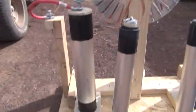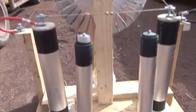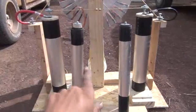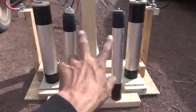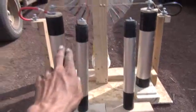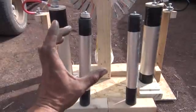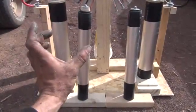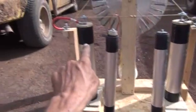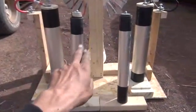What we've got here is a series of large-scale capacitors that I've used with the Wimshurst electrostatic generator, so we can do small-scale and larger-scale capacitance experiments. It's just a simple PVC pipe design. The large ones in the background are made from 3-inch PVC pipe with a cork top and an interior lining of aluminum foil wrapped around a piece of paper, slid down inside the pipe.